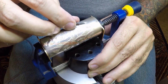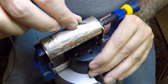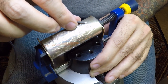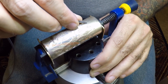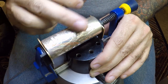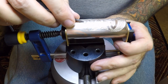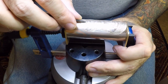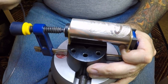Flip the metal out, get back in the cut. Continue your cut. You see a spot in your piece where your line width varies, not a problem. Get your graver back in and go over that line and boom, you're back to even. But when you do that, we're talking about a light, light touch, people. Light touch. Don't get in there and gouge metal out.